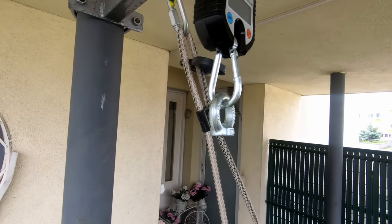The conclusion. So what we learned from this video, well, first of all, I'm overweight. I haven't checked my BMI index on the 10kg.org website. It's horrible. But besides that, it looks like the 3D printed bolts in horizontal position are much stronger than those in vertical position, which I'm not happy about, because with horizontal position, as you saw, we need some supports. So which one to use?